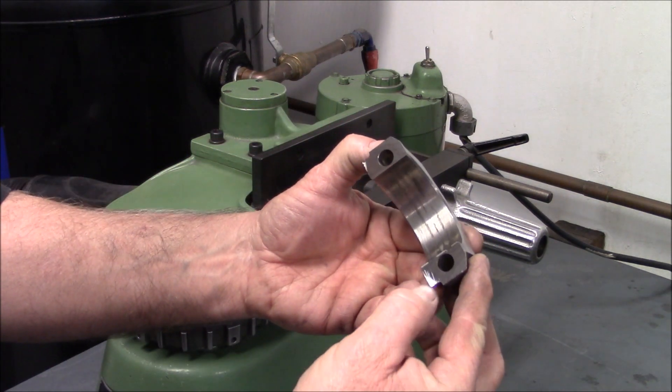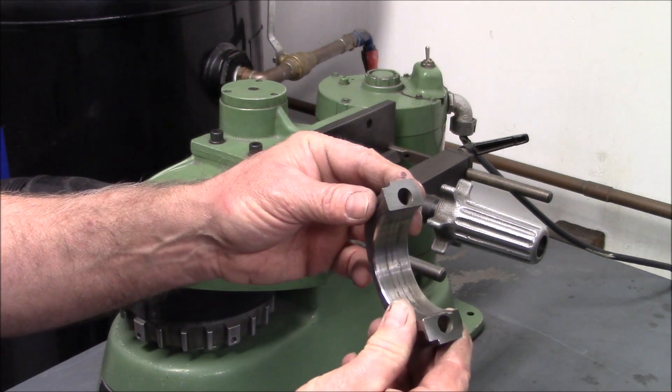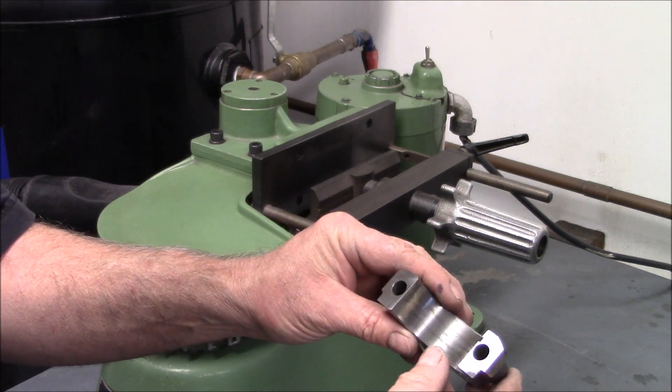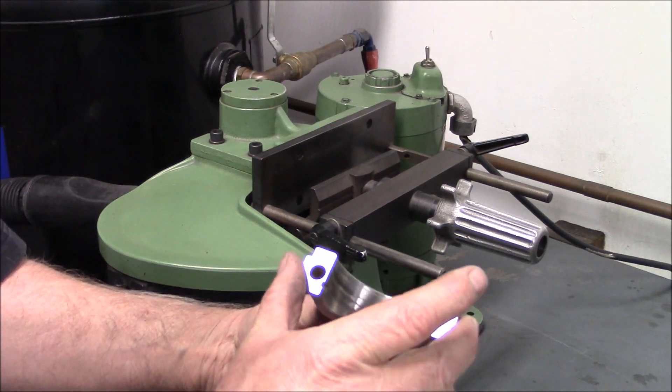This one's barely missing an edge out here. Another thing I want to mention: when you're building a flat tappet motor, you don't want to grind these off — that would sling oil up onto the camshaft. I believe that's what it's for.